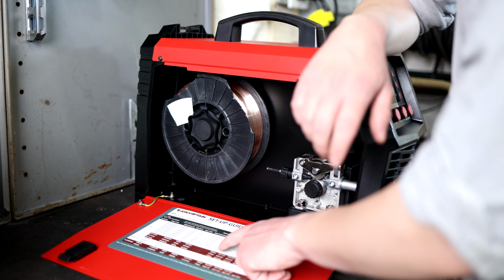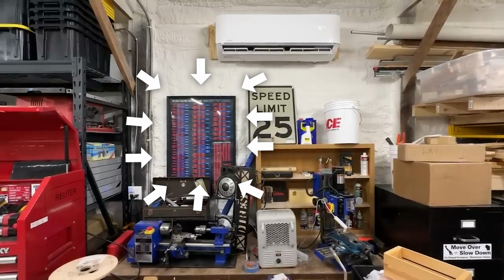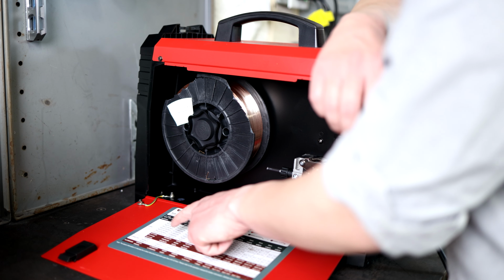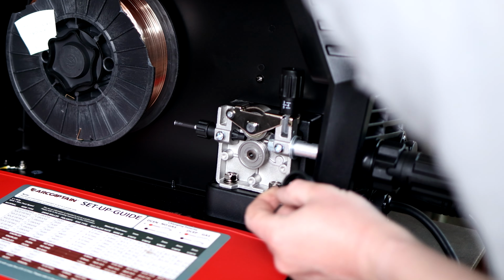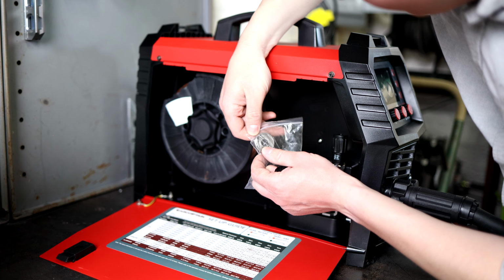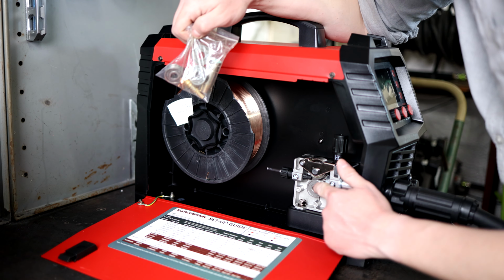.035 inch is equal to 1 millimeter per my Joffrey Croker handy fractions chart. And I'm using argon CO2 for gas, so I want V-groove roller, 1 millimeter size, which appears to be installed. Yeah, this has a V. Some of the other ones, like here's a 1.0 K, so that must be knurled, whereas this one's a V.